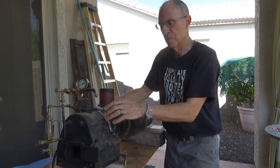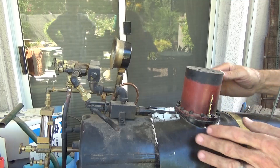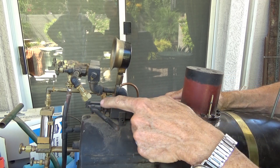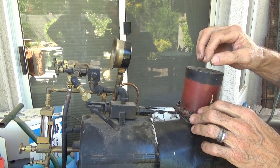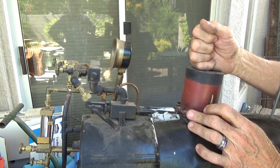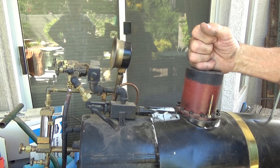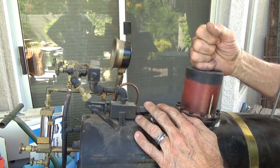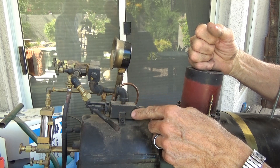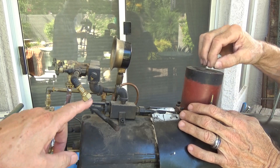So what we're going to do is remove the kaowool, put steel bands around the boiler, and put new wrappers on. In this instance, we have a cover which has been removed here, and that cover plate hides the lever and mechanism that operates the steam throttle in the dome. Most contemporary locomotives have the throttle in the smoke box as a ball valve with a rod running through a dry flue from front to rear.